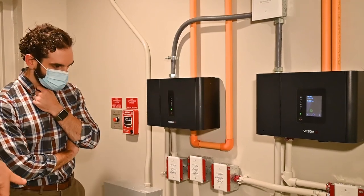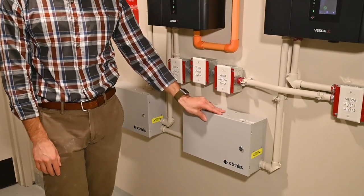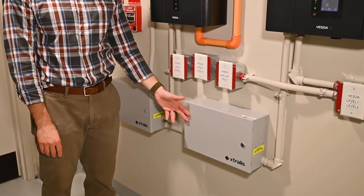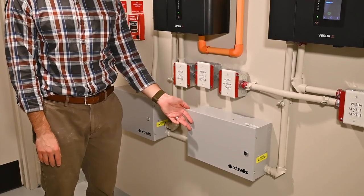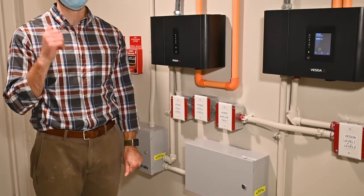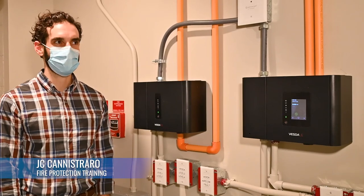What's in the gray box? Those are batteries — this is the power supply, going from 120 volt to 24 volt. You have one for each VESDA unit with two batteries in here. Since this is a Factory Mutual insured building, you have 90 hours of battery life — when I said 24 hours before, it's actually 90 hours for Factory Mutual buildings — so you would have quite a significant power outage for that to be an issue in Boston.